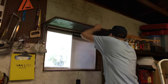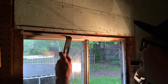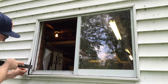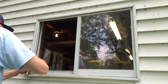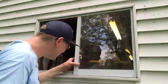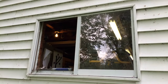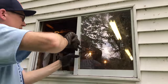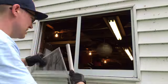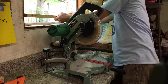So I'm getting rid of all the stuff that's in the window and around the window. When it came time to actually take the window frame out, I was a little bit stumped at first. I did a little googling and investigated how the window frame was set into the stud wall that makes up the garage's back wall. But in the end, I realized that what would probably be easiest was to very carefully, with gloves on and safety gear, take the old pane of glass out of the other side and then just knock this frame out, since the existing piece wasn't there anyway.